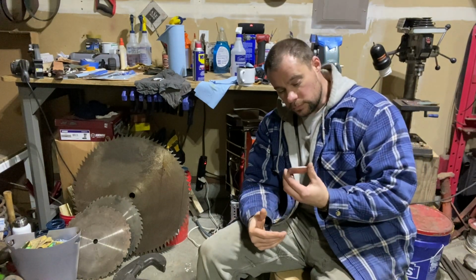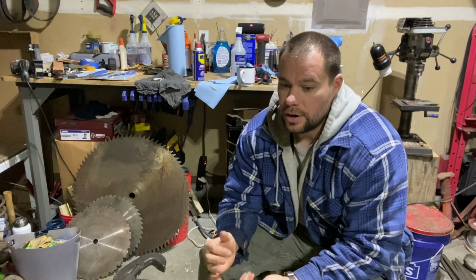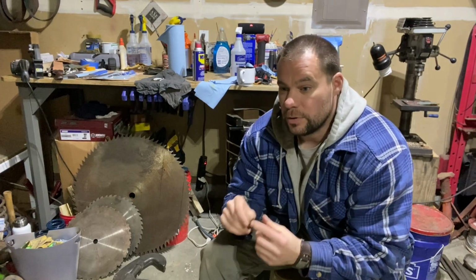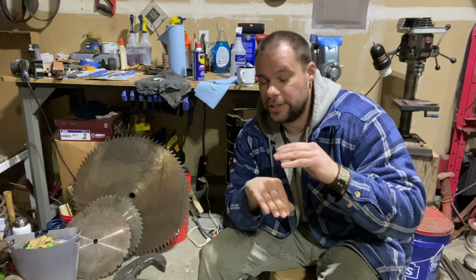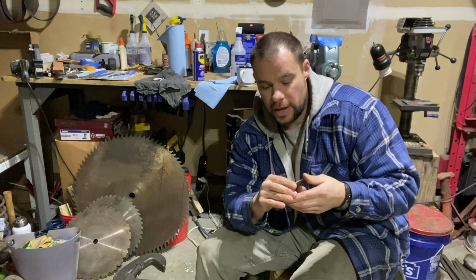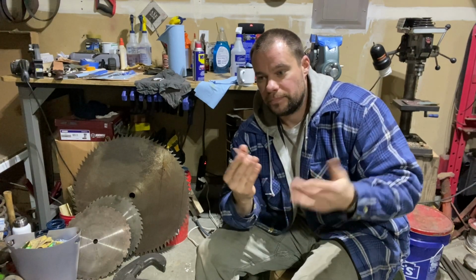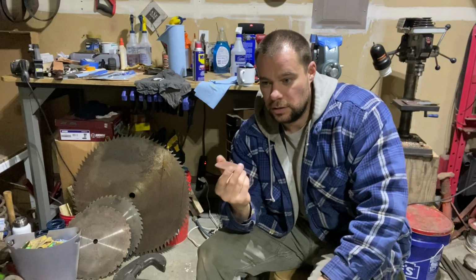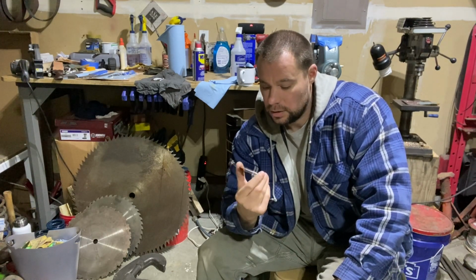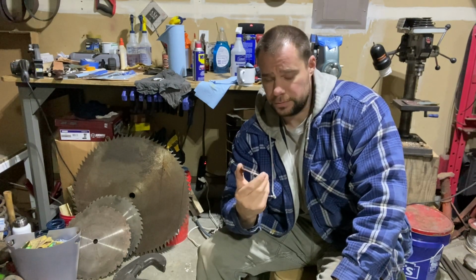And then also, I don't have a TIG welder or the proper wire, because I would have liked to have wrapped it with wire over those cages I made. That's all I had to keep the stack contained and tight, building a little cage for it. I think TIG welding is the way to go, or wrapping it with wire is better. But I mean, it worked. The cage actually worked pretty well.